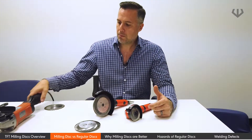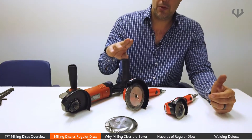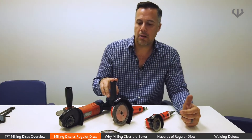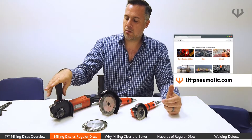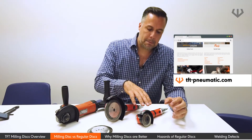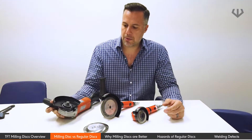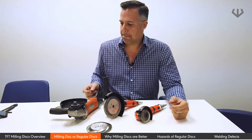Back in the shop — these discs can be used on traditional pneumatic or electric grinders. For the four-and-a-half and five-inch, we have 12,000 RPM, which is the ideal speed whether it's a pneumatic or electric version. For the smaller disc, it's typically easier to run on pneumatic tools, because running a three-inch disc in a tool with a large angle head gives you very little cutting area.